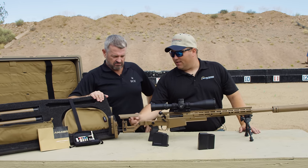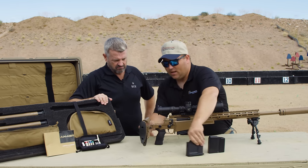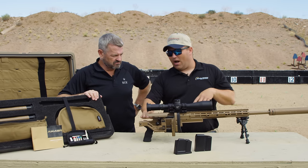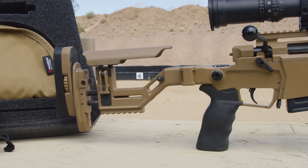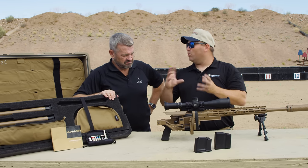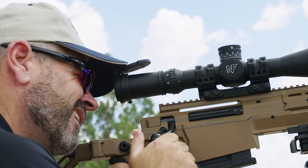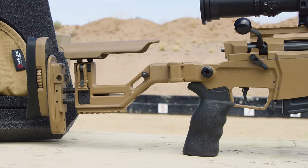Moving forward, you can see that this is cut out very large right here, and that's so it can capture your bolt handle. Very nice design — it comes around and captures everything very easily. It just makes it a low-profile system so when you put it in a pack, it's easier to hide the bolt and the stock; it's much narrower. The hinge is slightly redesigned but can be configured for right- or left-hand fold. The lockup mechanism is the same as all rifles they've used in the past — Crane Naval Warfare has tested it and it is the strongest hinge on the market.